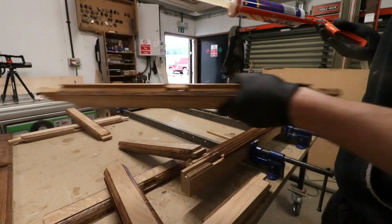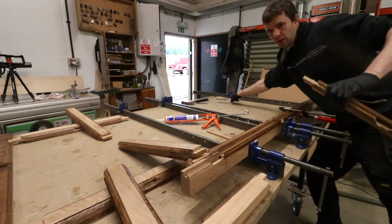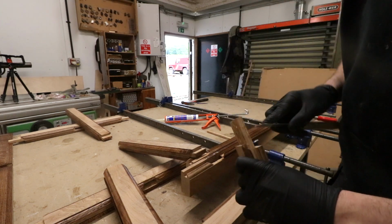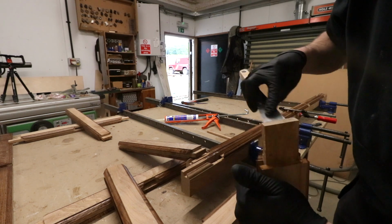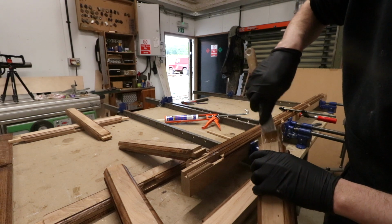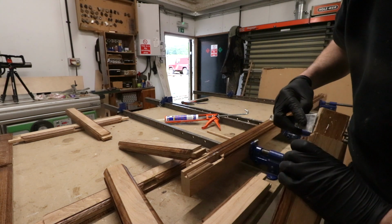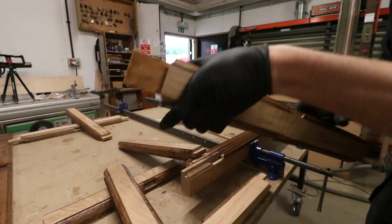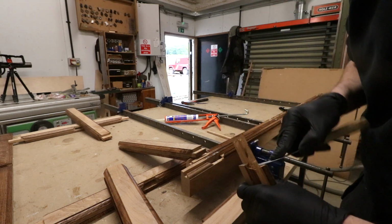When I first made the switch from Cascamite to Titebond, I really struggled to clean the glue off. I thought it was a bit inconsistent. Sometimes it would clean off and sometimes it wouldn't, but you have to have cold water, it seems to clean off a lot better. So I'm not going to put hardly anything in that scribe. It's going to get a bit scraped off the tenon here and run into the scribe, and that'll be enough. It's not really going to add any strength to the joint gluing that scribe section. All it's going to do is produce a load of glue squeeze out.